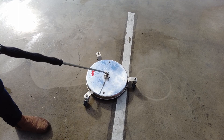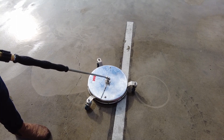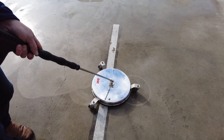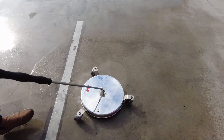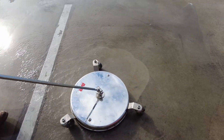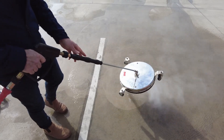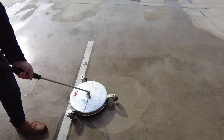Back on the 16 inch surface cleaner, now switching to the 3000 PSI / 21 litre a minute machine — so we've gained six litres a minute and lost 500 PSI. Running an 06 nozzle on the 16 inch surface cleaner, you can feel the extra flush, the extra rinse power from that extra six litres a minute. And that extra flow makes the surface cleaner hover nicely.